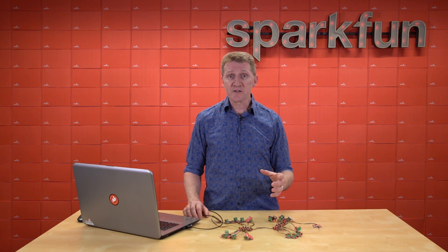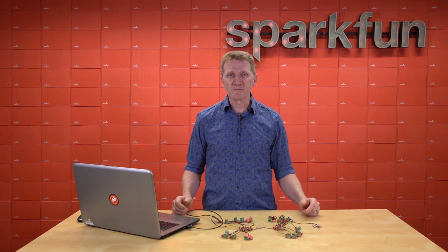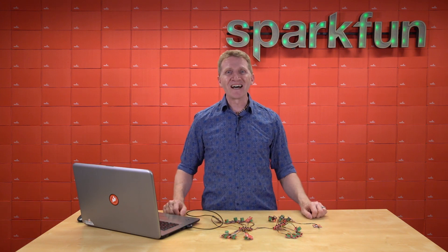I want to demonstrate a little multi-sensor data logging. I had hoped to go up into the mountains to a cave and measure ceiling height, humidity, temperature, and possibly even ambient light as I descended deeper. But with the current wildfires in Colorado, that's not possible, so I'm going to do it around here at SparkFun headquarters. I'll log data every three seconds, then throw it into a CSV file. One nice feature: when you plug in the battery it doesn't automatically start logging — you have to hit the reset button. Additionally, if it senses you haven't logged something for two seconds, it automatically goes into sleep mode. With a 200 milliamp-hour battery in low-power mode, by our estimation this thing can run for close to 10 years.